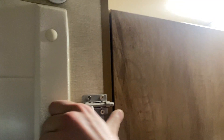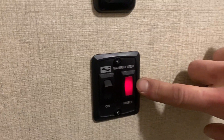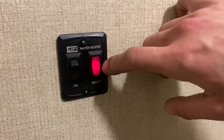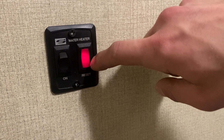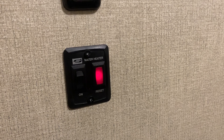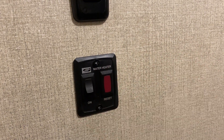We've got your shower here — standard head and hose, hot and cold water. This door, if we open it up all the way, actually closes off the bathroom from the living room. In the bathroom, you get your light switch up on the wall, and we've also got your hot water tank switch here. Turn that on, that red light is going to come on letting you know the ignition sequence will start. Once that light goes out, the sequence has started and it's going to try three times. If after the third try it hasn't fired up, this light's going to come on and stay on — at that point, go use that reset button we showed you outside. Sitting right here, you can actually hear the whir of the flame, so we know it's good.